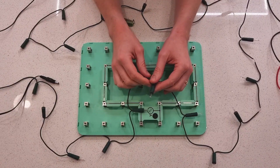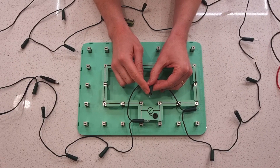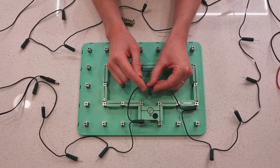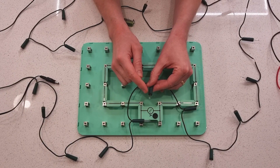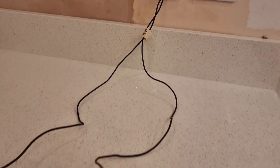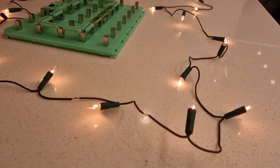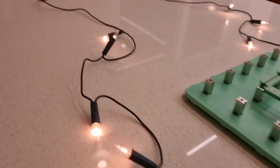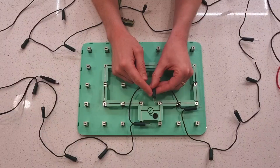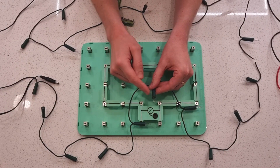Now there's one very strange thing about these decorative lights — each one of these little lamps is rated at 12 volts, so that means if you put any more than 12 volts through it, it's going to melt the little filament inside and that lamp is going to stop working. However, we've got all of these lamps connected to a 230 volt supply — actually in reality it's probably more like 240 volts when we measure it. So how can it be that we've got these little 12 volt lamps connected to such a high voltage and yet they continue to work? Well, the answer lies in the fact that these are connected in series with each other.